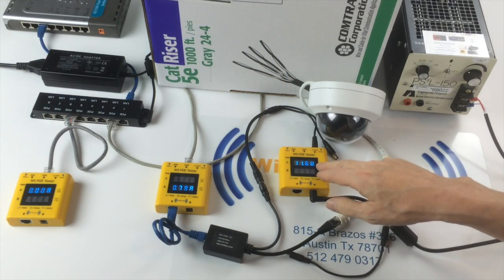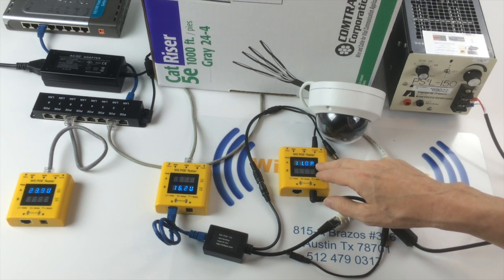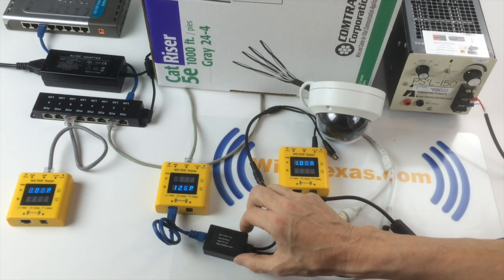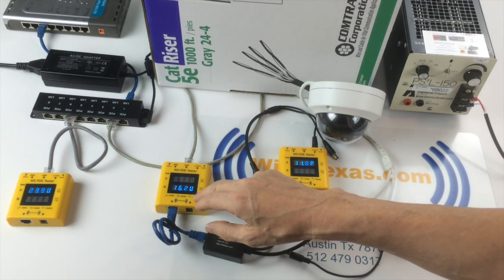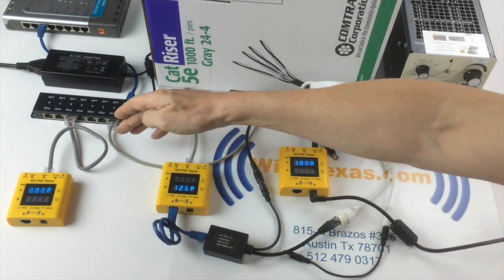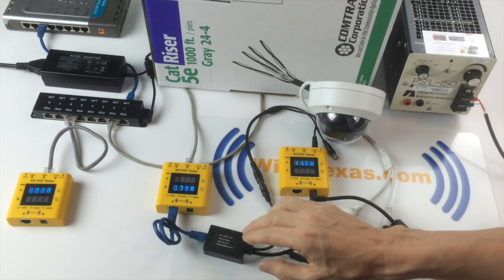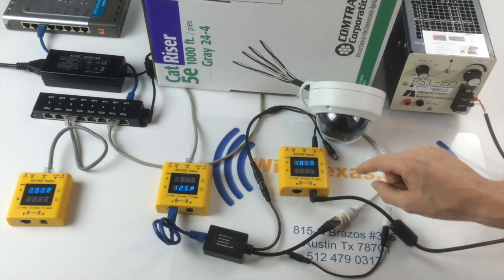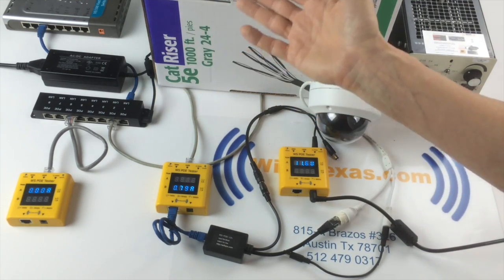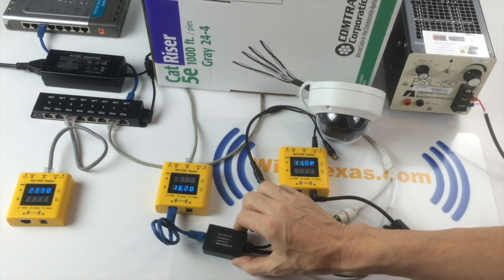So we're delivering now within the spec the 12-volt plus or minus 5 percent. We're delivering 11 watts of power. But notice what's happened here on the high side of the DC-DC converter — our voltage has actually dropped to 16.2 volts. This means that we're losing 8 volts in this 328 feet of Cat5. This is of no consequence because our DC-DC converter is going to reliably deliver the 12 volts to the load. So here's an example: an 11-watt load with 328 feet of Cat5 working perfectly, thanks to this DC-DC converter.